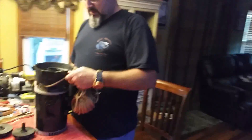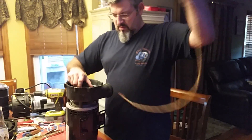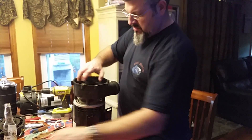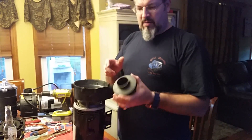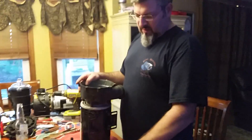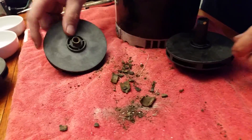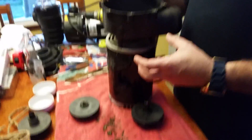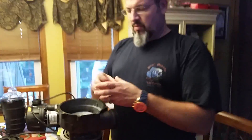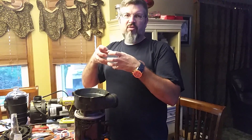Just take the rope off. Now, the first one we took out — you can see all the pieces here. All these pieces are what's left from this sleeve. What had happened is the shaft was caked with rust and the rust pushed out onto that sleeve, basically cracked it, and let the water flow right through and out of the pump.